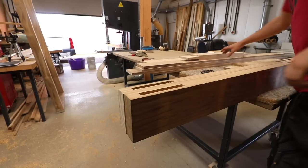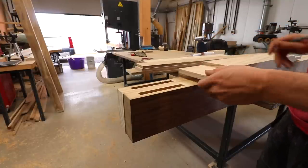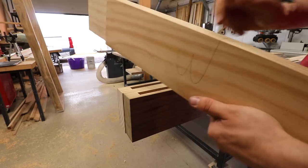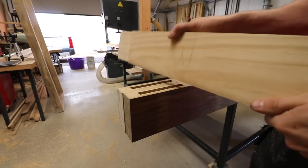It doesn't need to be a particularly clean cut, you're just making a clearance for that tenon to sit against the haunch. So now everything's prepped, we can cut the wedge room out, or the haunch area room, from the rails. We're working from the face, making sure the two faces are aligned and that edge mark is in the appropriate position, so pointing into the door. That's where we're going to machine a groove.